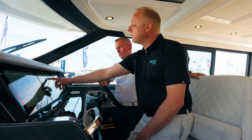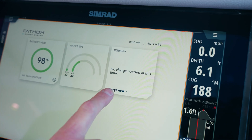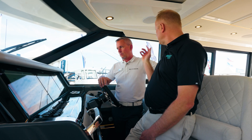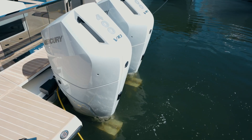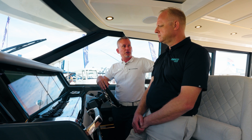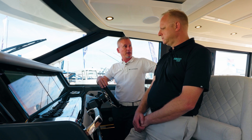If you're running low — say you're hanging out at the sandbar and need to charge the battery system — you can start the engine right from the display. It will prompt you to start it, you say yes, and automatically the engines will start. The controls will be locked out, it will go to 2000 RPM and recharge the battery system with about six kilowatts per engine. Thanks for joining us today. It's a great partnership between us and Navico and we're looking forward to expanding that on future models. Thank you for your time and explanation. My pleasure.